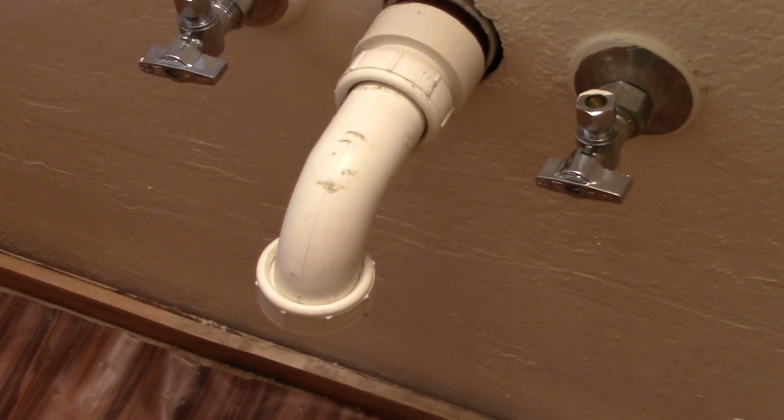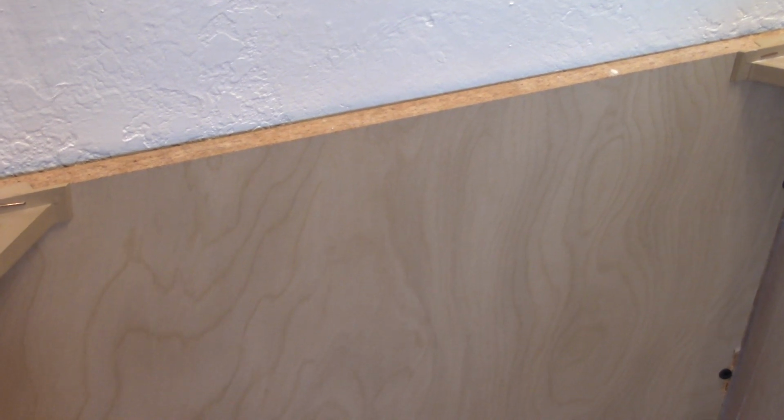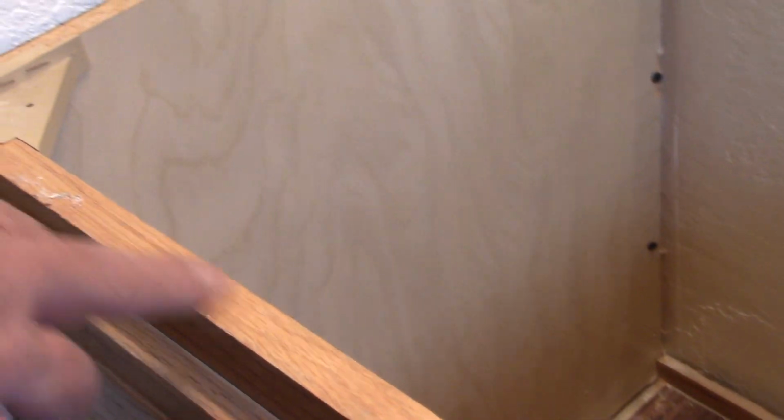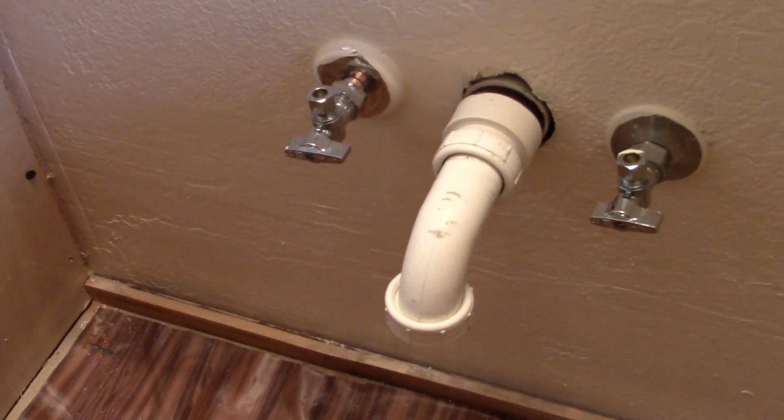After I put the sink in, I'm not going to bond the top. I'm not going to put adhesive on it, because I don't want it to be permanent. I'm just going to lay the sink in place and kind of caulk in the cracks so that if I ever need to get it out, I'll be able to get it out without a problem. Because the original installer didn't put adhesive in here, I'm not going to do it either. It's just easier for you to pull it just in case you have to get to the plumbing system. Okay, we're going to go get the sink now?